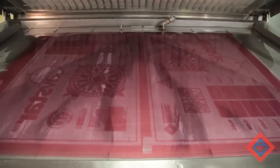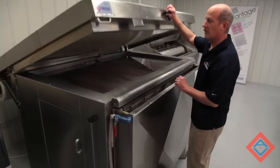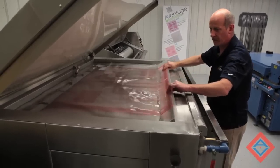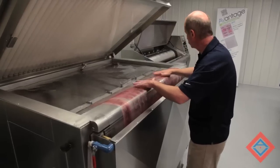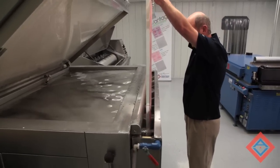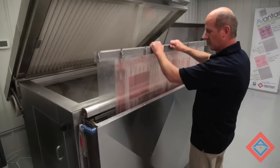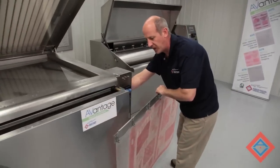It's completely underwater and ready for post. Post exposure is complete. Now we simply go back into the rinse to get the salts off of the plate. Be careful not to kink the plate. Turn the water back on. And then we put it in the dryer, where we'll dry it for probably 20 minutes for this gauge of plate.